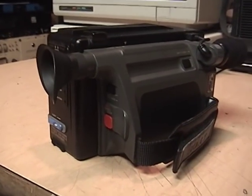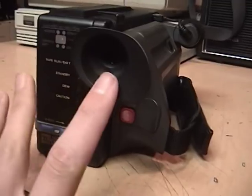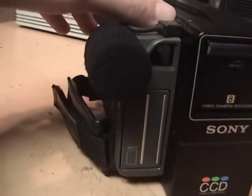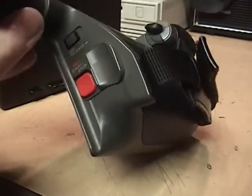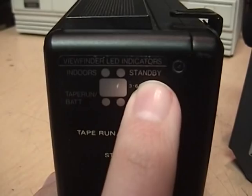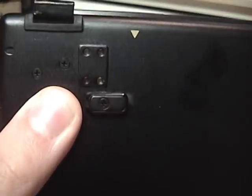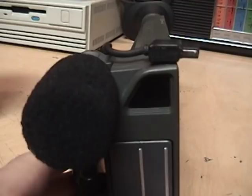This is a very simple camcorder in that there is no capability to play back your recordings. It's strictly for recording only, and in fact this viewfinder is completely optical — just a simple lens through to the front. You can actually dismount this whole side assembly, and there you can see how it's put together from the two halves. The only indications the camcorder gives you when recording is a couple of LEDs, which show up indicating things like white balance, when the tape is running, when the battery is low, and when you're in low light. Interestingly, those LEDs are on the main body and use some kind of reflector to make them show up in the little viewfinder. It's just an open hole through the front to give you a rough indication of what the camcorder is recording.